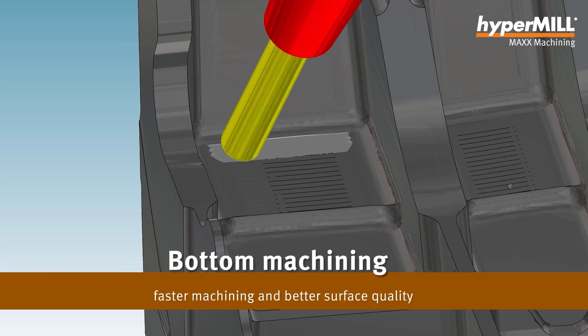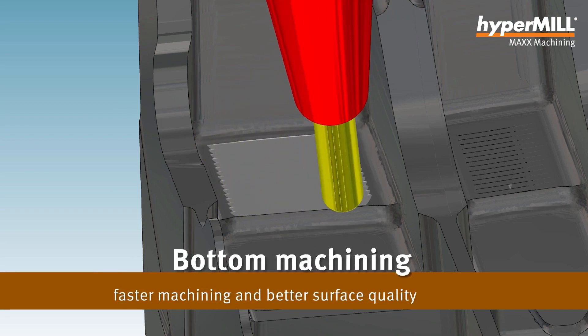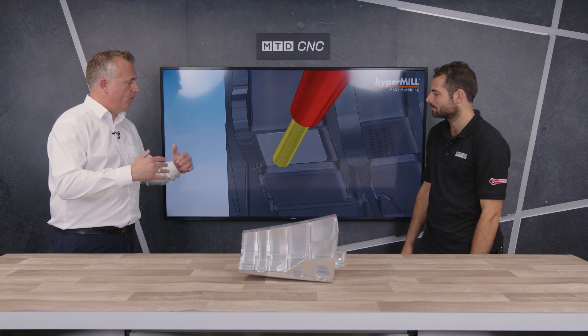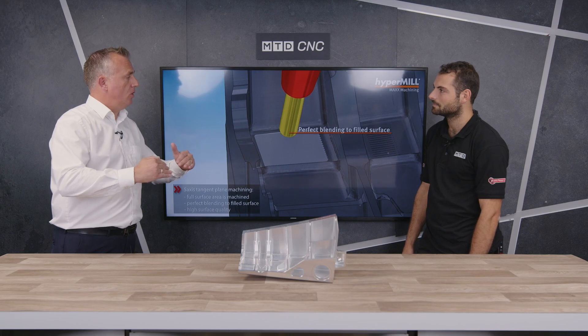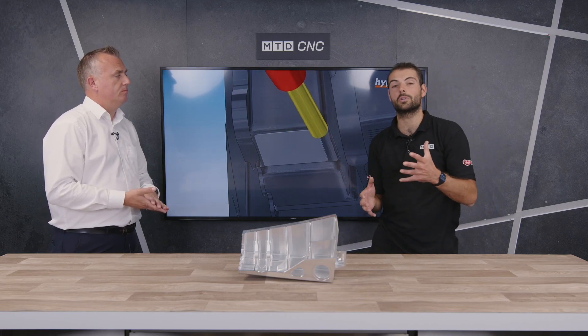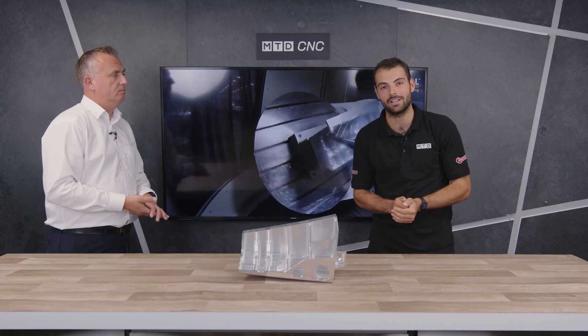This tool here is still a conical barrel tool, and you wouldn't be able to achieve this with a tangential barrel tool. It has a much larger cone angle — probably around 80 degrees — meaning you're pushing that barrel onto the floor of the tool and using that to finish the floor, then making sure with the blending pass it's all completely machined. So if you're trying to improve your finishing cycles and reduce your cycle time by up to 90%, you need to check out barrel milling and all the barrel milling cycles as part of MAX finishing from Hypermill.